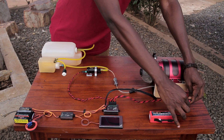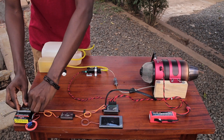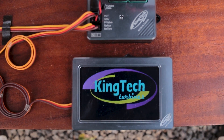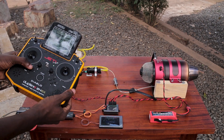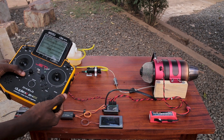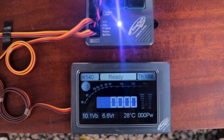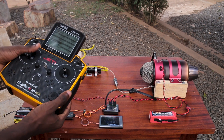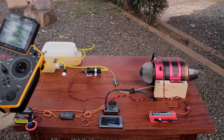Hook up my batteries. ECU is turned on. Let me get my transmitter. I need to raise my throttle trim to the idle position. ECU is armed. Engine is ready. I will have to move my throttle up and then down to initiate the start sequence. It's really going to get loud out here, so I will stop talking and get this engine running.